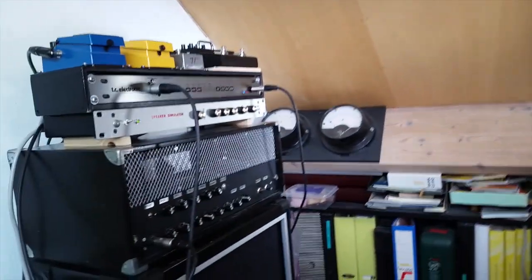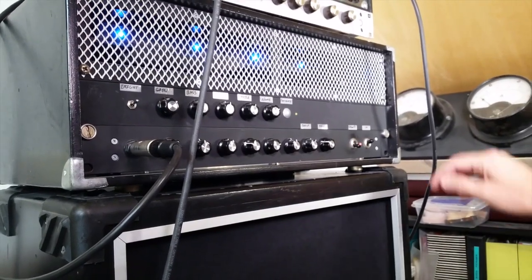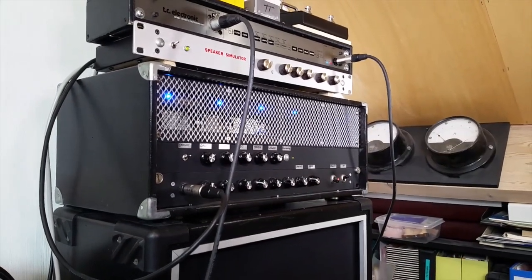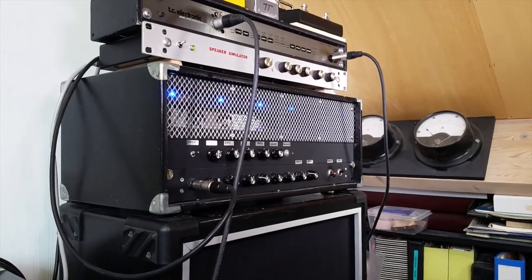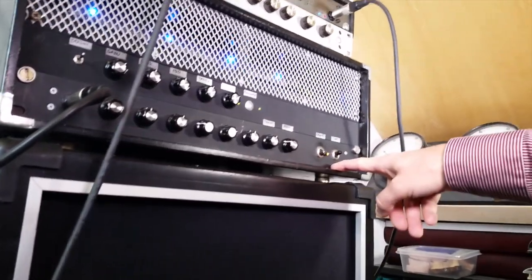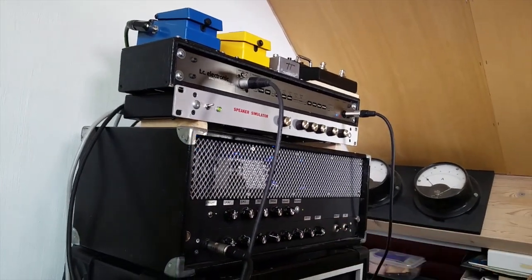Are you using Arduino? Yes, I use an Arduino in my tube amplifier for the pre-heat timing and channel switching. This is the amp where it's built in. When I switch it on you can see the starting cycle running, and after 30 seconds this LED will turn green, meaning the pre-heat time is over and you can put the high voltage on the tubes by switching standby to on. The whole boot-up sequence of this amplifier is controlled with an Arduino Uno Mini. It also monitors the mains voltage — you can see it's now turning orange, meaning it's ready to switch on. And now you can hear it humming and it's operating.